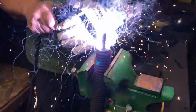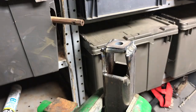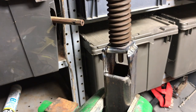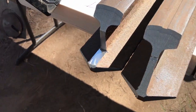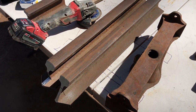Now for some welding — on the end of the screw, this small bolt will fasten the extension to the screw. This plate is where the bolt will be fastened. A quick test fit and it looks good. Remember, the screw will be rotating while the tubing will not rotate but will only slide vertically in order to press down on the piece. Notches were cut in order to provide a place to bolt everything together.